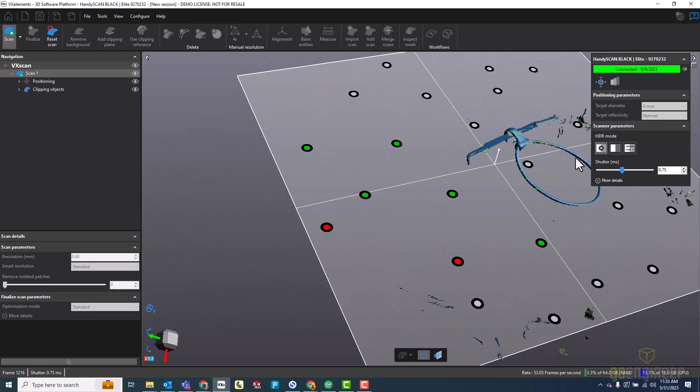So that's my design mostly finished. However, now we need to do a little bit of DFAM — Design for Additive Manufacturing. If I printed it like this, the printer would have to fill all of this internal volume with support material. And while that's not the end of the world, it's also going to cause a little bit of an issue because it will be hard to get out. I would prefer not to have to remove any supports, or even better, be able to print this with no supports whatsoever.